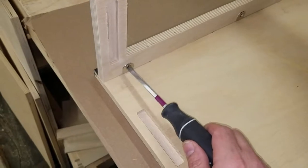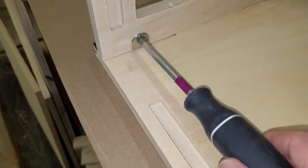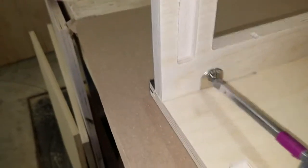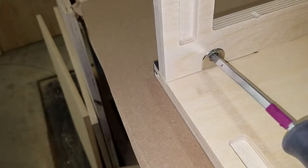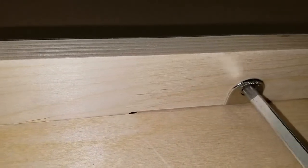The important thing is these fasteners do about a quarter turn. So if we go all the way counterclockwise, go a quarter turn, you will see that the mark will become about straight up, maybe 12:30, not past 1 o'clock. And so watch as we tighten that. We actually get a tight fit; this crack size shrinks when it pulls it in there.